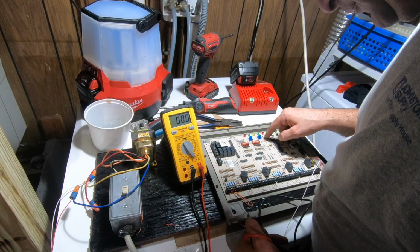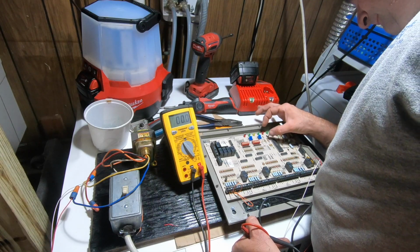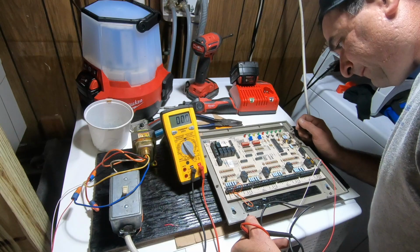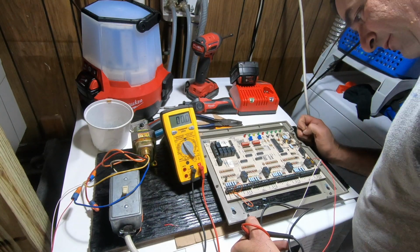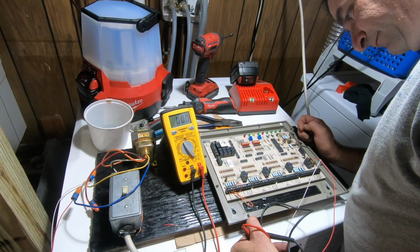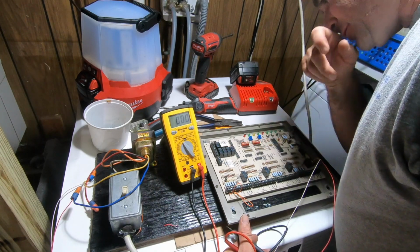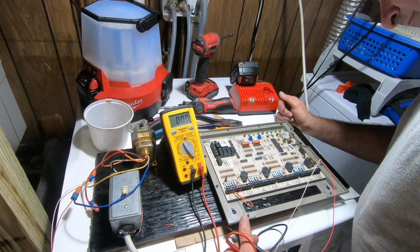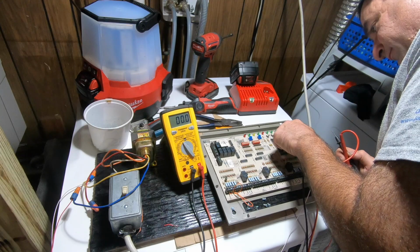So, dual fuel settings. Settings high at all because I'm not doing anything with it. Okay. OB energized, doesn't matter. Dual fuel disabled. Heat fan is HVAC. Other set of switches, S4, this is all second stage operation, third stage operation. Eight is unused, switch 8. They're not hot.